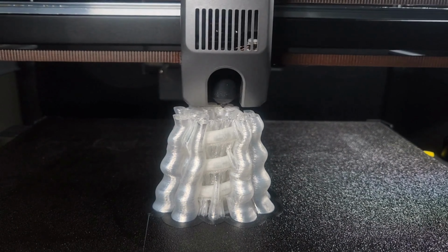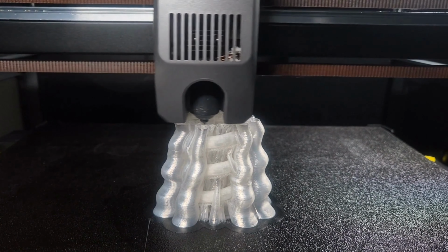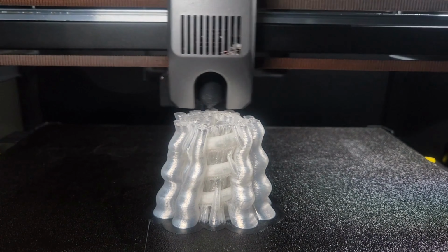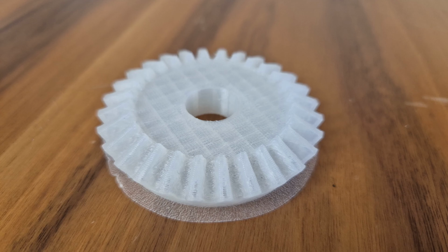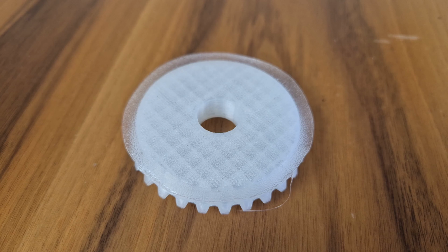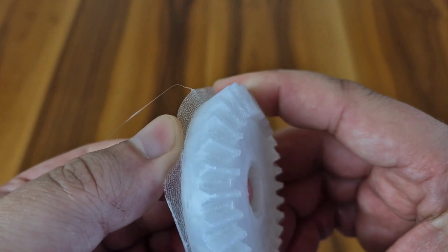The biggest issue is adhesion to the print bed. Once again, by using an enclosed heated chamber and applying hairspray to the print bed, I was able to achieve the printing I wanted. One of them is the gear you see here. The model printed successfully. There was no warping from the print bed. To demonstrate how well the layers fused together, I deliberately did not cut the surrounding brim I created. Even removing the brim from the model is quite difficult.